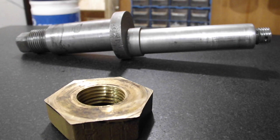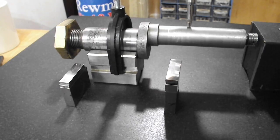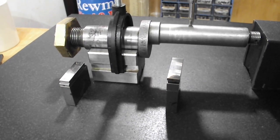Apart from finding out what material is required, I needed to find out the existing dimensions and find the offset between the two stub axle components. This stub axle is offset because these microcars are chain driven, and in order to adjust the chain, the stub shaft was offset and the chain is adjusted by rotating the stub shaft to achieve the desired tension on the drive chain.